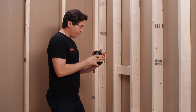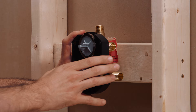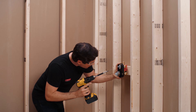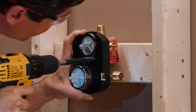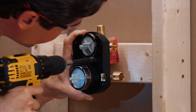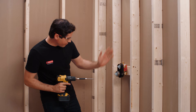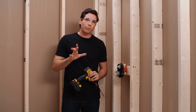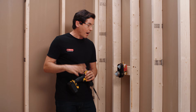Once I've got the valve figured out, I'm going to go ahead and place it on my wall. I've marked a quick center line here just to make sure I'm getting the valve in the perfect location. I'm going to hold it on my wall, keeping an eye on that center line, and also making sure everything looks nice and level side to side. Once I'm happy with it, I'm going to grab my drill and run a screw in one of the two holes directly below my diverter valve at the top into my blocking. Making sure everything looks nice and level and driving it into the wall. That feels good and tight. Now before we make those plumbing connections, if any of your connections are going to be solder connections, you want to make sure you remove your test caps, your bonnet nuts, and your black plaster guard, and set those off to the side to make sure they don't get damaged. Go ahead and make your connections, then come back and we'll move on to the next step.